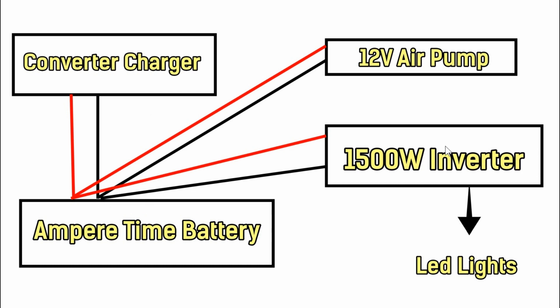And you'll see what the problem I'm facing. Also, I'm going to put this 12 volt air pump — without a load it draws about 8 amps — as another DC load. You'll see it has the problem even without an inverter, just with an air pump. And I'll finish the video showing how it should work using an AO lithium battery that works properly.